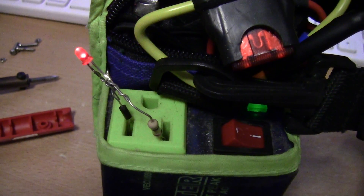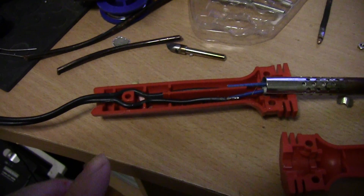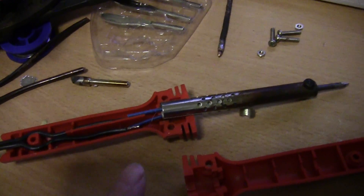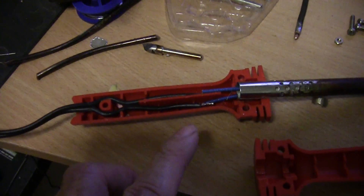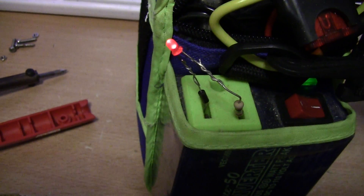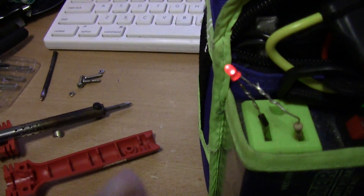Technically, if you do it this way, the LED would have some kind of flutter or flicker, but I don't actually see that. I think it would work well in the soldering iron, as long as you don't open it while it is plugged in. Of course, you wouldn't open it if it's plugged in anyway, because the iron will be very hot, plus the circuit would be live — if you touch any part of the AC it can shock or kill you. But having the LED indicator would save me a lot of pain, since I've forgotten more than a few times that this soldering iron was plugged in.